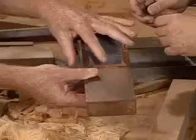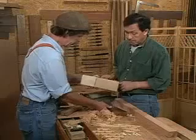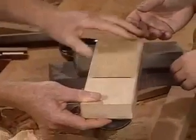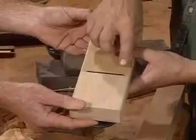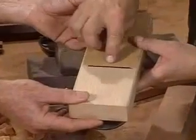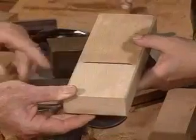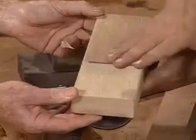And so here, this is basically the jig, and you've got this one adjusted to cut, but I noticed when you turned it over, it's polished, and this is the direction of travel. It's polished right here and here. This seems to have been scraped away. Yeah, that's right. The Japanese plane only hits the wood, the surface, right in front of the blade and right at the very front end of the plane. So it's hollow in here, and this is given clearance as well. Most importantly, completely given clearance in back of the blade.